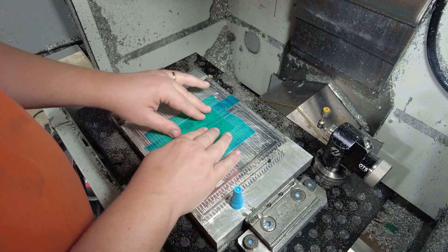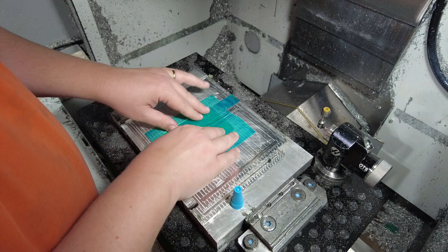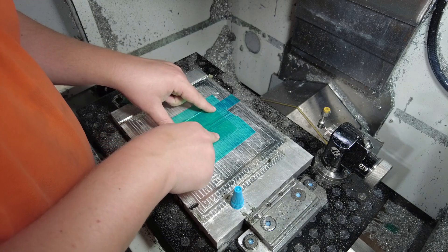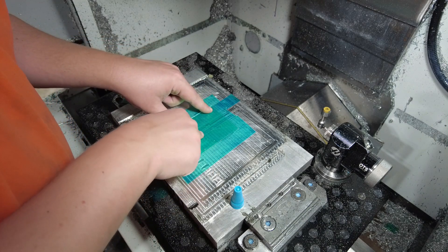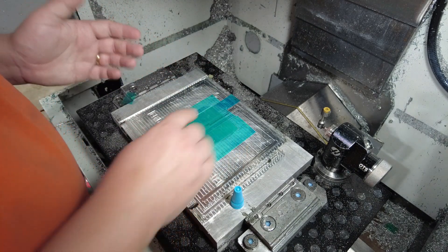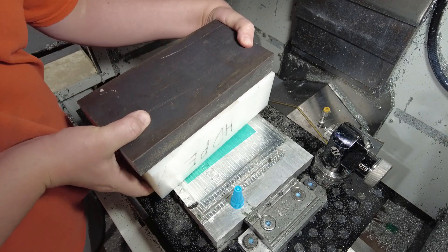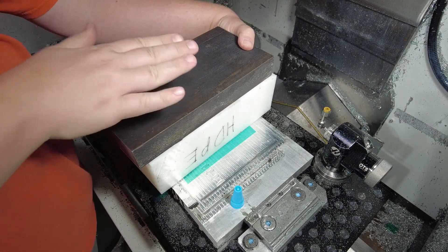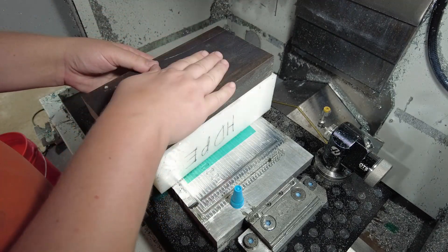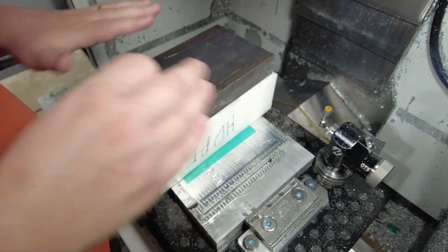I'll plop it down and give it some little wiggles since the glue was poorly distributed. Because the acrylic is clear, I can actually see how well the glue is spreading out, and I can see the center point mark I made on the fixture for alignment. Then I get it aligned as best I can and put something heavy on it. I use a big block of HDPE as the first layer because glue doesn't stick to it and it's less likely to scratch the acrylic than a steel plate.